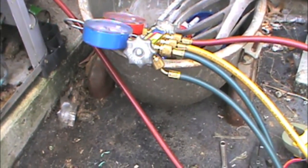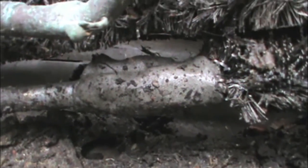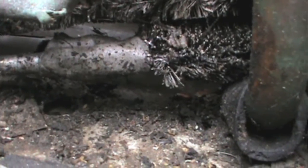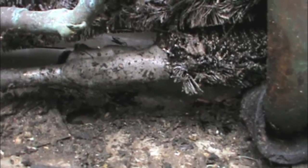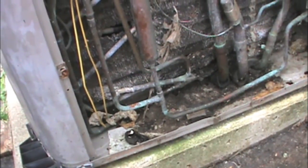Oh man, you've got to love it. I'm just going to show it to you one time. Somebody tell me — what is that? I think that's J.B. Weld, guys. So we have found our leak, I believe. The detector detected it. This is the first time in my career I've ever encountered J.B. Weld with heating and air. J.B. Weld versus the 250 PSI R22 — R22 won.